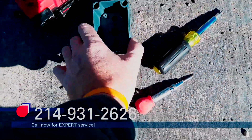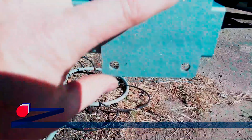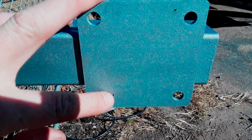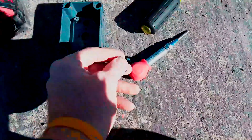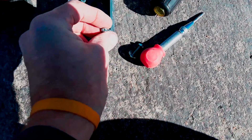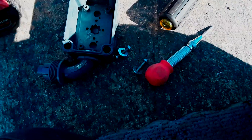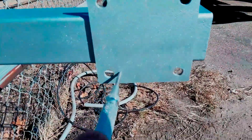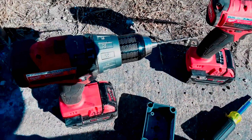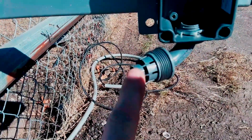I'm going to mount the head for the receive side on the latch part of the gate. I've marked my holes right here on the plate that we're going to mount it to, then I'll drill it out so the screws can run through this hole right here. I've got some washers on the back to help keep it stable. After marking my holes I used my punch to get a little divot so I'm on center when I drill.